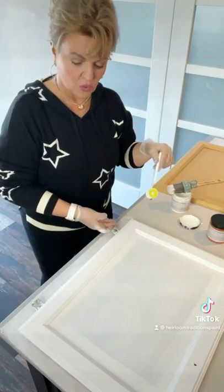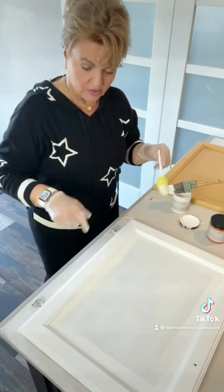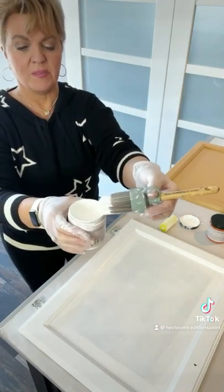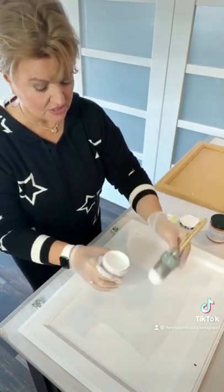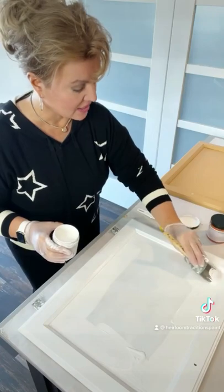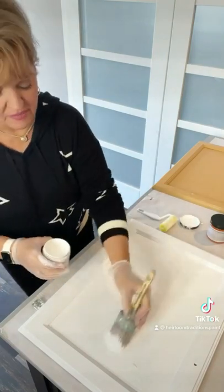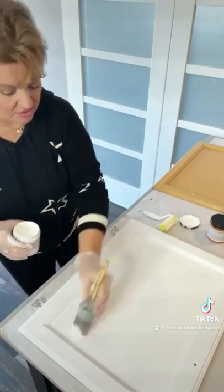Right now, let's concentrate on the face of the door. After you've finished the edges, concentrate on going around your hinges. Now the next step is going into the center of the door. Again, one-third of the brush right down into the paint — whether that be a quart, a pint, or a sample. I'm going right around the edges, not up onto that little edge I just rolled. There's no point — it's got plenty of paint. Not stingy with the paint; put on a good amount. See how it's pooled up there? If you started rolling through that, you'd get a pile of bubbles. So don't leave it piled up anywhere — just move the paint around until it's evenly placed across that door.